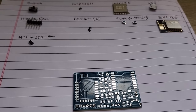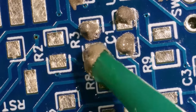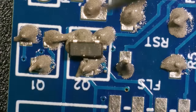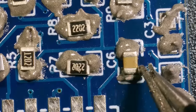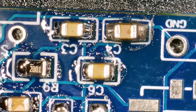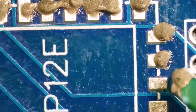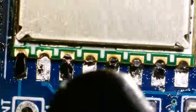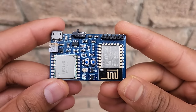It is time to solder all components on the receiver PCB. I picked the necessary components again, then using my microscope I placed solder paste on the PCB pads. Then I placed all the components one by one. I soldered all the SMD components like resistors, capacitors, transistors, LED, push buttons, and micro USB port. After soldering all those, I soldered the ESP8266 raw chip and LoRa module SX1276. Then I soldered the battery connector, switch, and male header pins. Finally, the receiver is also ready.